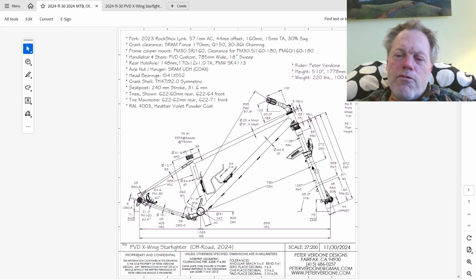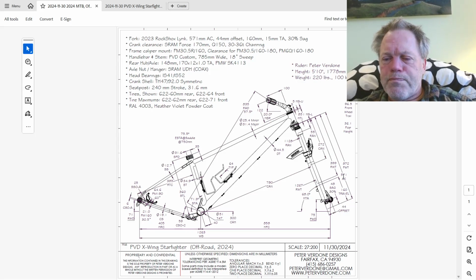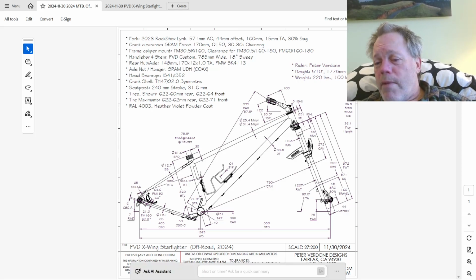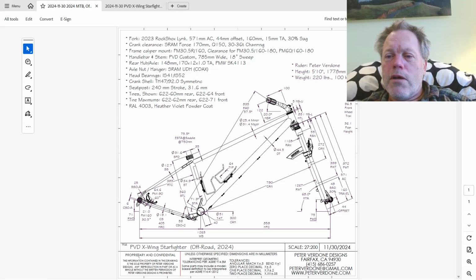And these numbers come up when you're doing dynamic systems, when you have head angle changing and stuff like that. If you know these values, they don't change, and you can be accurately predictive about conditions by referencing those rather than some others. Rear wheel trail, that's where the rear wheel trail will intersect the frame. So when we get into our fundamental drawing for the bike, we know where that position is. And if we're getting into real dynamics or kinematic type things, we know where that location is because that's important. There we go. Hopefully everything's marked here well.